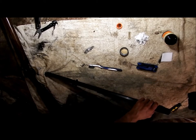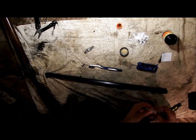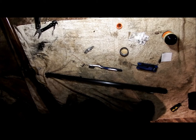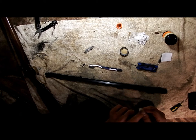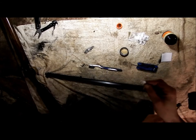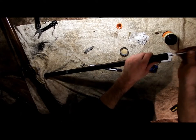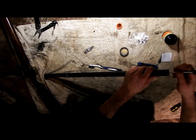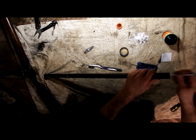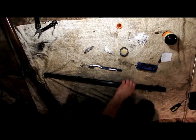But now remember, you don't want oil stayed in there because it's going to contaminate your powder. The oil doesn't dry very fast. So put another dry one down. And with this, what I like to do is give it a bit of a wrap. You'll see. The reason for that is it acts like a Q-tip almost. You get more dryness on the edge here. So when you go in, it touches all the way to the end there. And you're not having this puddle gathering up of oil down in that little cup. It's pretty much a cup down there that holds your powder, and then the ball sits on that. So you can see it when you shine the light down there. So anyway, that should be good.